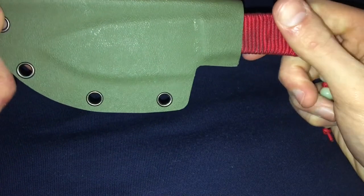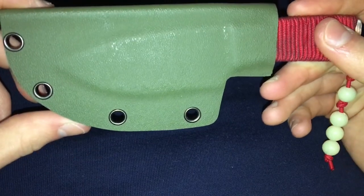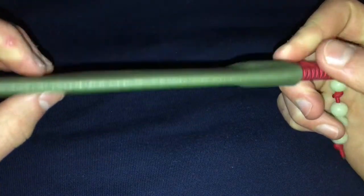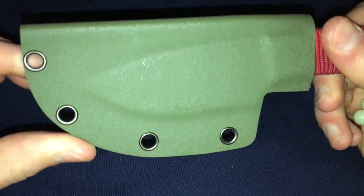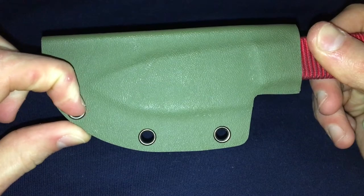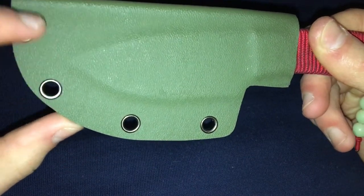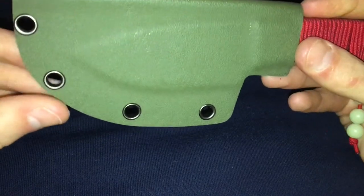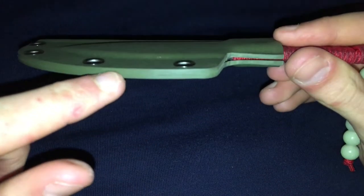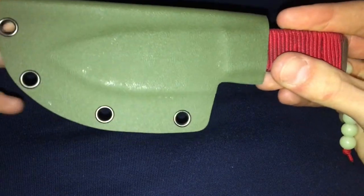The third knife was a bit of a work experience because I ended up making my first ever kydex sheath for it as well. The sheath is two millimeter thick olive drab green kydex. The rivets — I'm not too sure what size they are but I drilled them out with a 6.5 mm drill bit. I'll leave a link to the rivets in the description, and the kydex is also from eBay so I'll link that too. I hand-sanded the sheath to 240 grit just to make it look a little bit nicer.